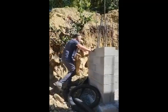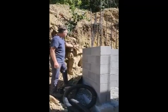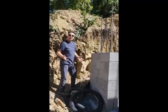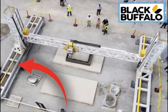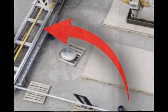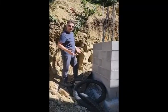So this, for example, makes all other types of construction problematic. The other printers can't do basements and can't get a printer on the outside of this. Let's talk about Buffalo — before you can even start printing, you've got to build yourself a sidewalk on both sides, lay the horizontal supports down on both sides of the building, and then let that cure before you can start setting up your structure.